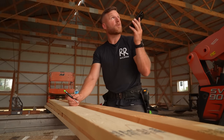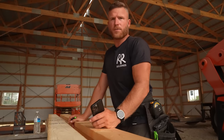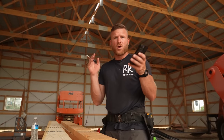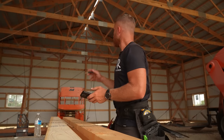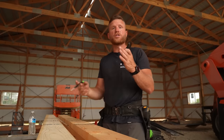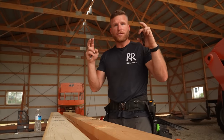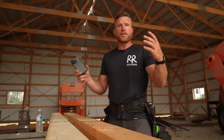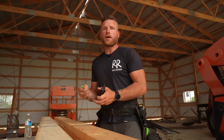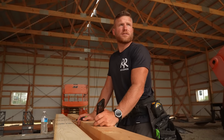I'm going to try to do as much prep work as possible before I go up there, because the less material I've got to hold up and the more I have already pre-cut and marked, I think it's going to be a lot easier. We always use structural end trusses, so when you look at our end trusses they'll still have the structural webbing that our intermediate trusses do — we just have them add end framing so we can apply steel to it with horizontal girts. With that, we don't really have to worry about an actual structural header like a big LVL or steel I-beam on this 24-foot door — we just need to make sure the door header is structurally sound for wind loadings and to support the weight of the door opener pushing and pulling that door open.